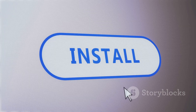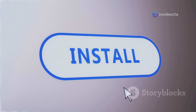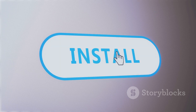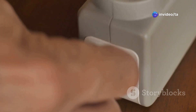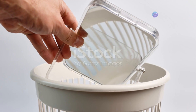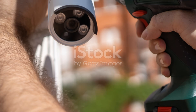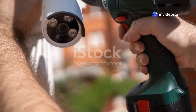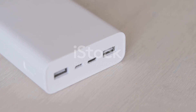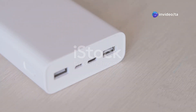Use the Raspberry Pi Imager to install the Raspberry Pi OS onto the SD card — this is a specially designed operating system optimized for the Raspberry Pi hardware. Follow the on-screen instructions to complete the installation. Once done, you can disconnect the Raspberry Pi from the monitor, keyboard, and mouse; it is now ready to be integrated into your smart mirror. Place the Raspberry Pi in the frame, making sure it is sturdy, provides adequate ventilation to prevent overheating, and that all connections are intact. Then connect the Raspberry Pi to the monitor using an HDMI cable to configure and test your setup.